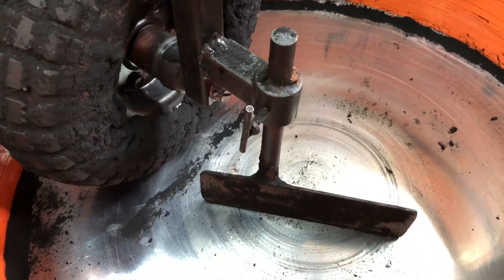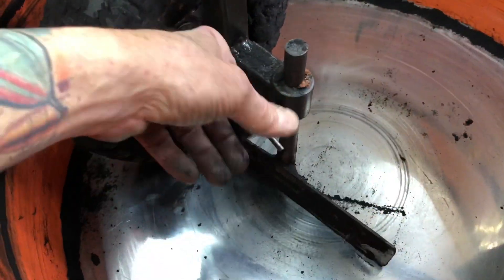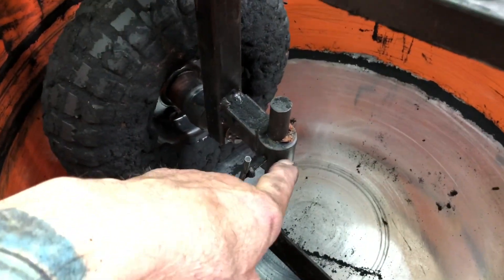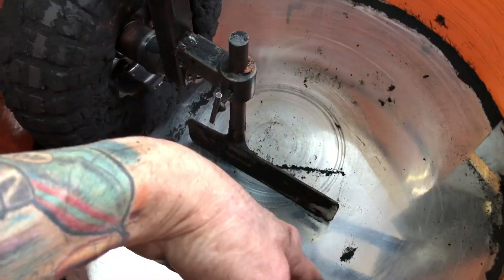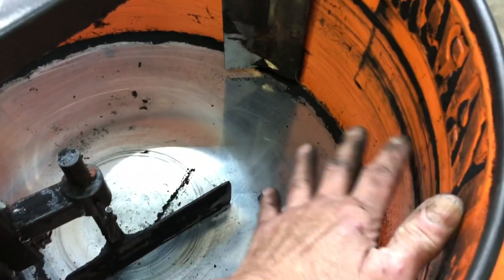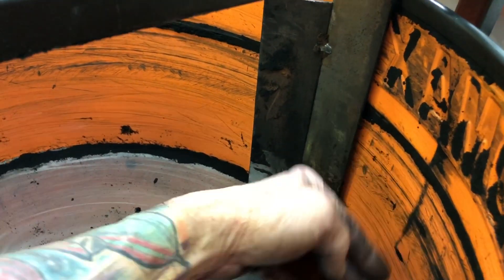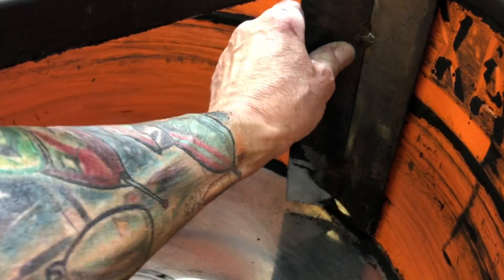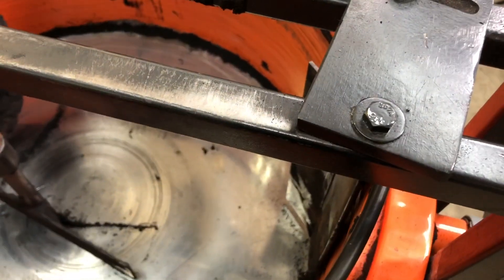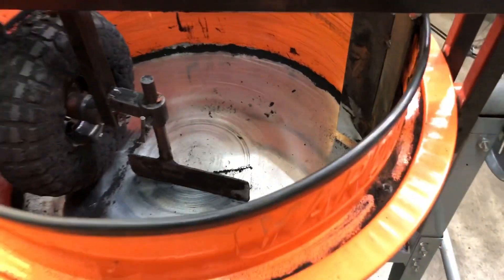Let's move on to this center scraping blade. I made this adjustable, and honestly, I've never adjusted it — it just sits right there. You could use a bolt or threaded rod with a couple of nuts, which would be a lot easier than what I did. But you've got to have that, because it's going to direct the sand to the outside — it'll start piling up here. Then this side blade, which is almost touching, is going to take that sand and start rolling it over, and that's where all the mixing happens — you'll see it in the video. This is scrap; you can see it's just tack welded. Works great. As long as you get this blade to run right next to the edge, you'll be good to go.